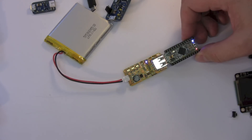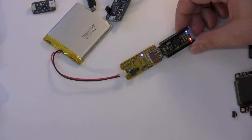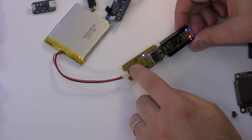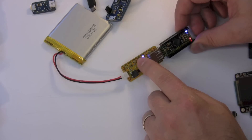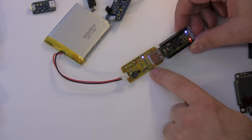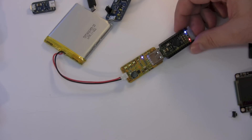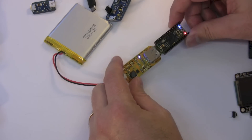Things like LiPo cells can't be discharged too deeply or you won't be able to use them again. By cutting or soldering across these little jumpers, you can set the low threshold to 3.75 volts, 2.33 volts, or 1.17 volts. You can even run this off a single 1.5-volt cell and get 5 volts out. Once it hits that threshold — by default set to 3.75 volts, which is a safe lower limit for LiPo cells — it turns off its output to protect the battery. It also has a low battery warning output and logic outputs, so if you wanted to sense low battery level — for example in a remote data logging system — you can use an Arduino input to read the low battery output and do a nice shutdown.